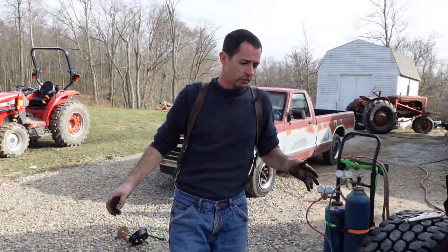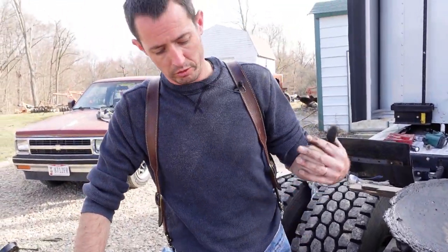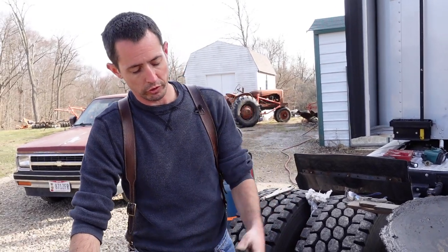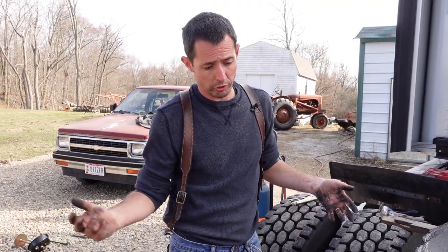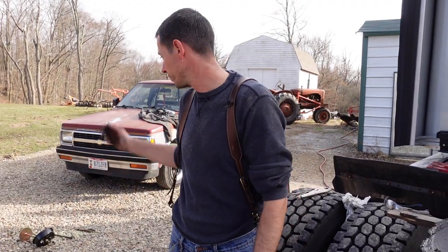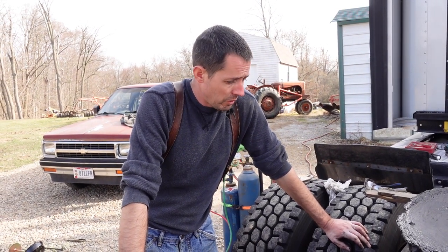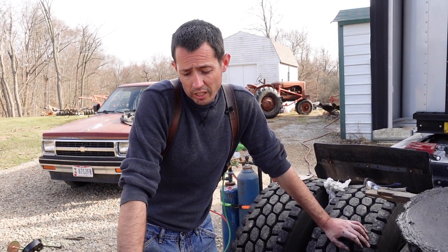And that, people, is the easiest way. Like, if there's nothing wrong with this portion, why do you want to take that off and cut that rod, measure it and all that when there's nothing wrong with it? So I always, like I said, buy a whole brake chamber, just do the piggyback switch. You can actually buy a piggyback kit if you don't want to take that off like we did over there, but they're about the same price, and like I said, now we got extra parts if we need them for whatever. So that's pretty much it, guys. Nobody died or got maimed, so we successfully did a little brake chamber job. So that's pretty much it.